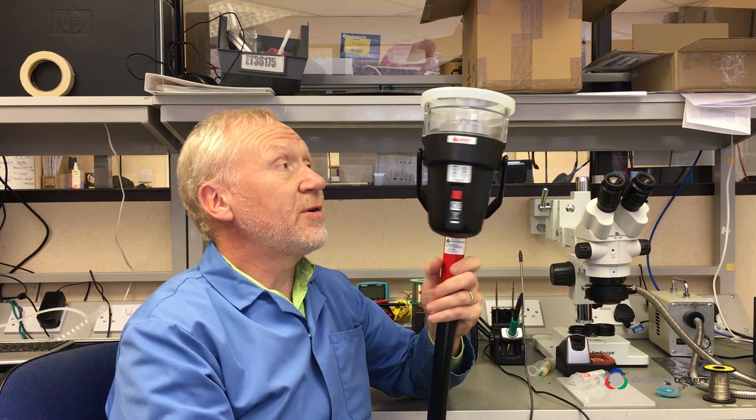As the SOLO 460 uses a pencil-thin beam of hot air across the test cup, a top tip is to rotate the SOLO 460 when you're actually testing the heat detector. This evenly distributes the heat and should result in a faster activation.